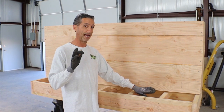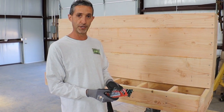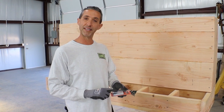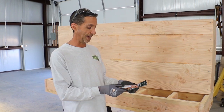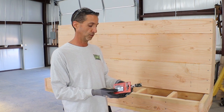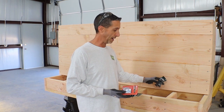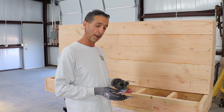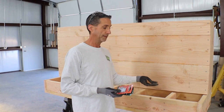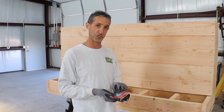And then one other thing we're gonna add to those hinges as opposed to screws. These 2.5-inch hinges come with wood screws attached. Now we've learned pretty quickly that pigs do a fantastic job of ripping these right out of the wood. So instead we have some machine screws. One machine screw is about 1.5 inches long and another is about 2.5 inches long. The idea is the 2.5 inches will go through the backboard on the top hinge, and then these smaller screws will go through the bottom. That way the pigs have less of a chance of ripping the bolts out versus the screws.